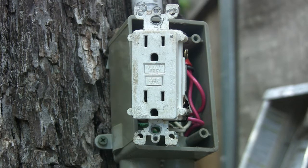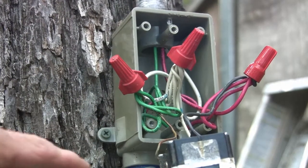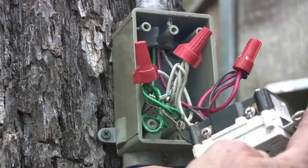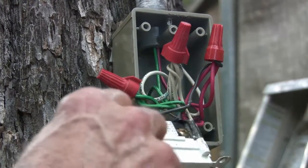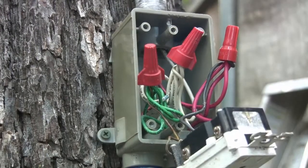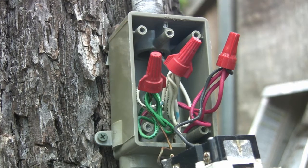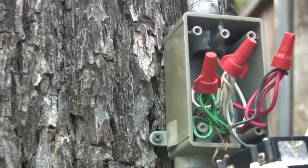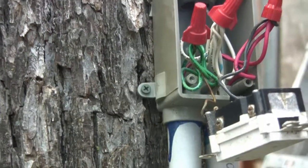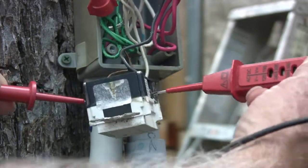Always be careful. We can see the black wire — the plug is hooked up right. They've got the neutral going to the silver screw, the black wire going to the brass screw, and the ground to the ground. Just to be safe, I'm going to go turn the power off. I'd rather be safe than sorry. Power is off, but I'm still going to check it — I don't assume anything in electricity. We're definitely dead.